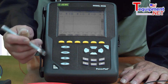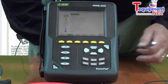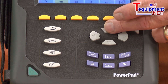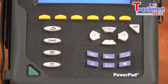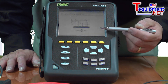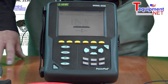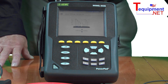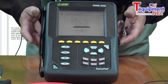The setup screen allows the user to simply press the setup button and navigate down to the choices they want. If you wanted to pick the type of test to perform, you would go to electrical hookup, press the enter key, and then scroll through several varieties of hookups from single phase through multi-phase. Here we're looking at a three-phase, five-wire hookup — a typical Y connection. We sample each incoming waveform from the current and voltage channels simultaneously, 256 times per cycle, giving us a very high-quality, high-fidelity reproduction of the data.